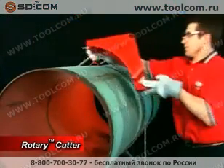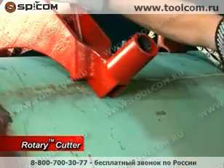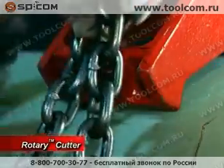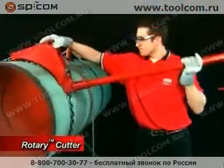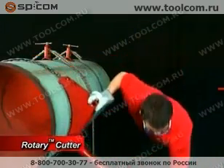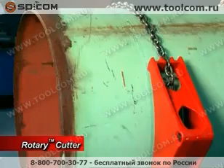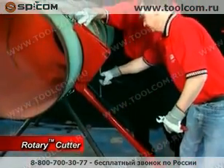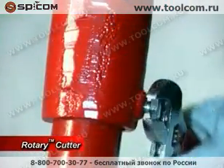Start by placing the red triangular saddle approximately 4 inches away from the area where the pipe is to be cut. Secure the saddle to the pipe using the provided chain. Now place the torque arm on the triangular saddle. Be sure the saddle is placed on the side of the pipe that is to remain after the cut is made. Make sure the pipe is resting on the ground, then fully tighten the black bolt and nut with the provided wrench assembly.